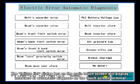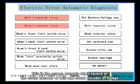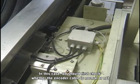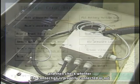The failure list dialog box on the main touch screen will display the interface of automatic diagnosis on the touch screen terminal. When the machine fails, the touch operating terminal will automatically pop up and display the associated self-diagnosed fault tips. This is a screen prompt when the count encoder of the belt or the count encoder of the bridge fails. In this case, we should first check whether the encoder cable is normal, and then check whether the connection is properly connected.